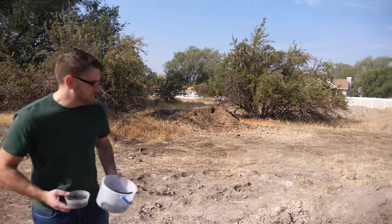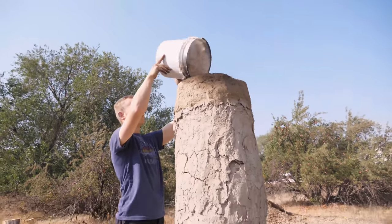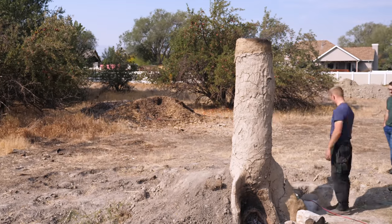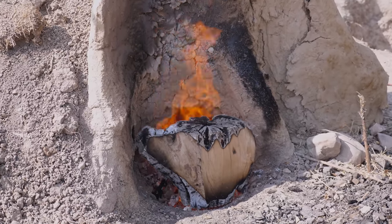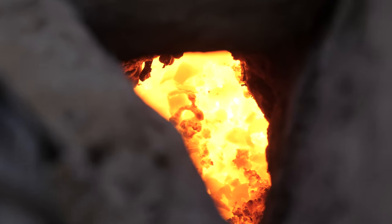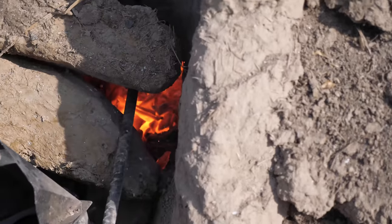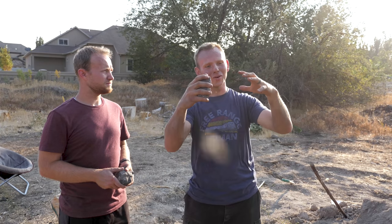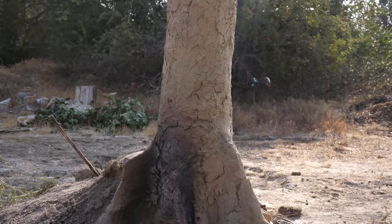The first major difference is that their furnace is bigger. One advantage the height gives is more time for the carbon monoxide to seep into the ore and strip off the oxygen. The other major thing we're going to do is poke it with a stick — you really need experts to tell you that. One key problem that can go wrong is getting enough air into the furnace. Slag drips down and can cake around the air inlet, physically blocking that entryway, so you jam a stick through the air inlet hole every so often. Another problem is where the charcoal forms a roof with a void underneath — you poke the roof with a stick to make sure all the ore falls down to where the fire is actually happening.